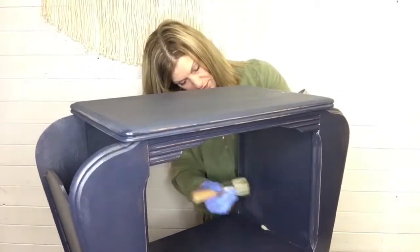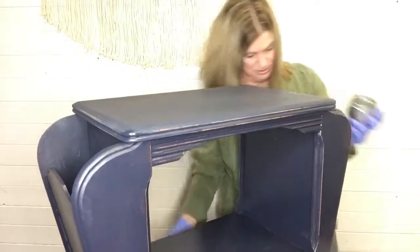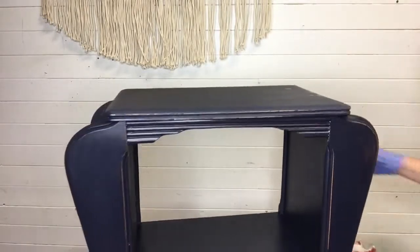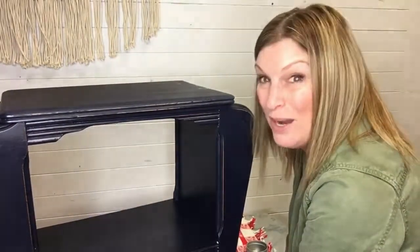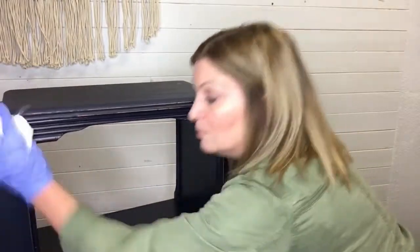For me it just really enhances and finishes the look of the piece. Apply about that much and then wipe off the excess. Once it's dry it'll be fine to touch — you can pick up the piece and move it, you're not going to get fingerprints. When it dries it's nice to buff it out. Some wax brands require buffing and some don't. You can take a clean dry towel after it's dry — like after a couple of days — and buff it out by hand, though that's kind of labor-intensive. It just kind of sets the wax and enhances the polished look.